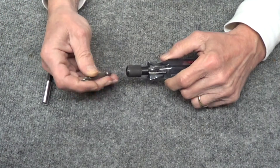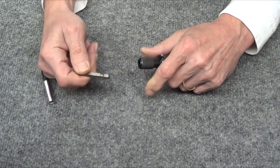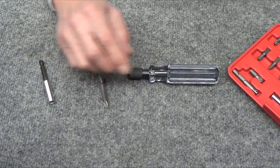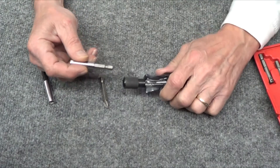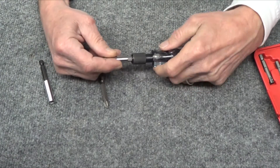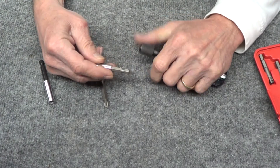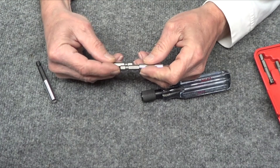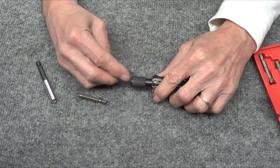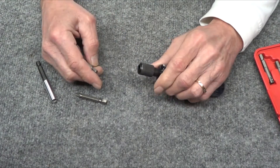When I got it, I just took all my regular bits and put them in there and it detached great. But then I took this one from the Harbor Freight set, put it in there, and couldn't pull the collar back — I couldn't get this bit out. Somehow they've done this wrong; it's not deep enough or it's slightly too far forward, so it doesn't allow the ball bearings to go deep enough to pull the collar back to clear the shelf inside.